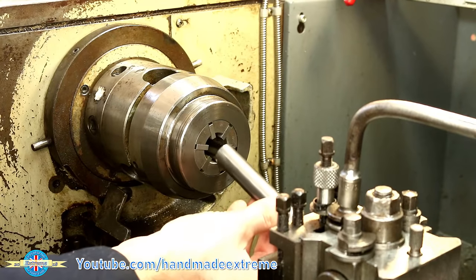I then parted off another piece of the 38mm round which is going to be the hub for the handle. I drilled two holes and — with my Feeling Lucky trousers on — had a go at power tapping the threaded holes for the grub screws in this one. Thankfully got away with it; it's always a bit touch and go. That just fits on there like that, and then there'll be another two grub screws going there, and what we need is three spokes for the handle. To make those I don't have a tube notcher, so I used a hole saw in the milling machine to put some bird mouths on the ends of the spokes. The last one — thankfully not the first — grabbed the hole saw, ripped all the teeth off, and made a bit of a mess.